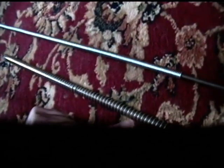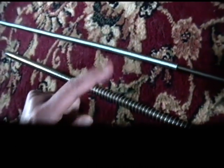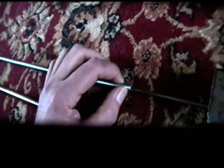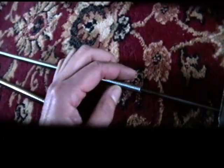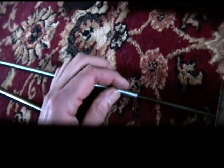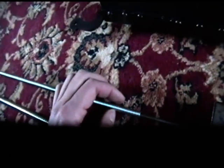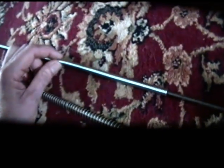I basically want to pull it out so that the gap between the coils is three times the thickness of the coil. Now, I think the music wire on this is 1.25 millimeters thickness, which is a fair gauge of spring, really. I'm guesstimating that this is going to do its job, but it just does not close up sufficiently enough. I really need to adjust it.